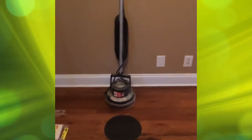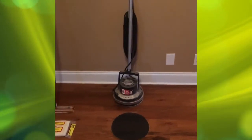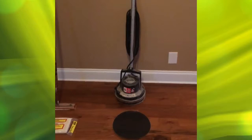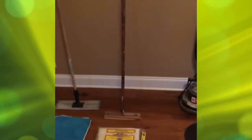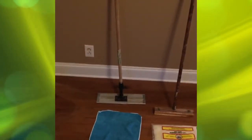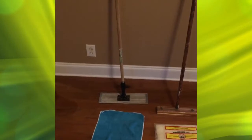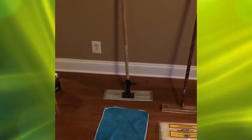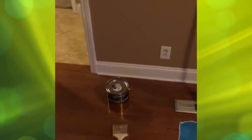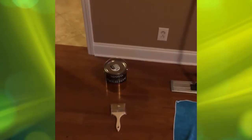The list of items you need for this task: a floor buffer and a sanding screen. I'll give you another quick and easy way you may be able to do it without having to use the floor buffer. You need an applicator with a lamb's wool head. We use a janitorial supply velcro head, but you can also use a simple Swiffer with velcro and a microfiber rag. And of course your polyurethane — the finish you like. We're using a satin on this one, and a short brush.